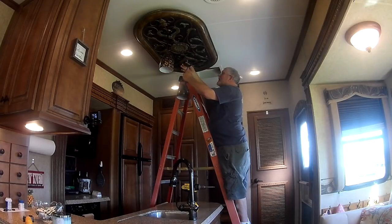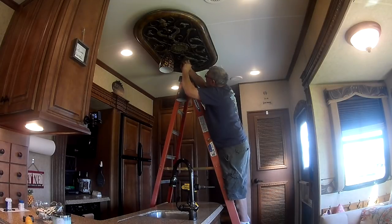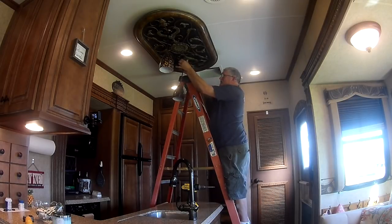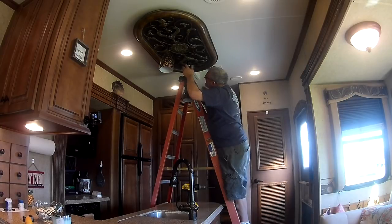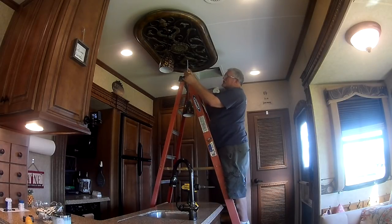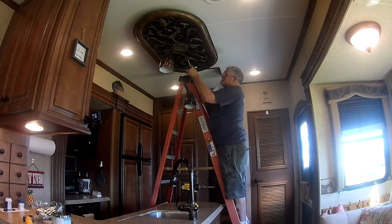And we'll have connectors on it that I can undo. And I don't want to lose that up in the ceiling, because it probably won't be any fun trying to get it out. There it comes. So in this one here, the black is connected to the purple white, and the white's connected to the white. So we'll undo these. And there's the light fixture.